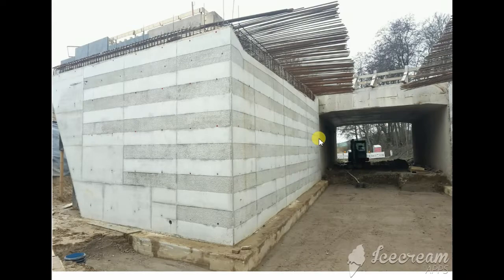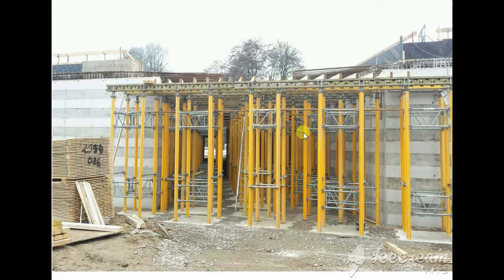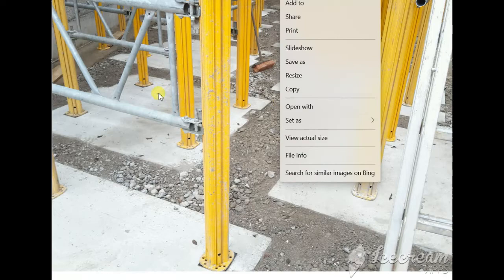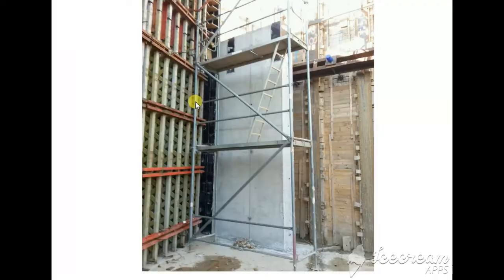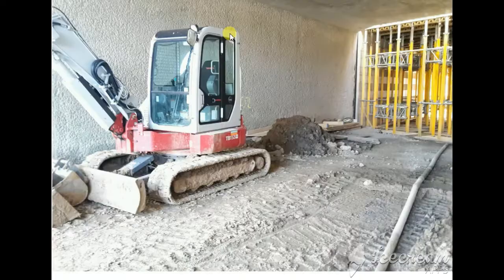So now we're going to prepare the scaffolding. As you see, there is not much heavy load, that's why they use this kind of scaffolding. You're going to see many other bridge types with heavy duty scaffolding. If you like, just keep in touch and subscribe. Most importantly, the foundation for the scaffolding should not come directly above the soil. You see this is the scaffolding work and we start preparing the shutter for the deck slab.